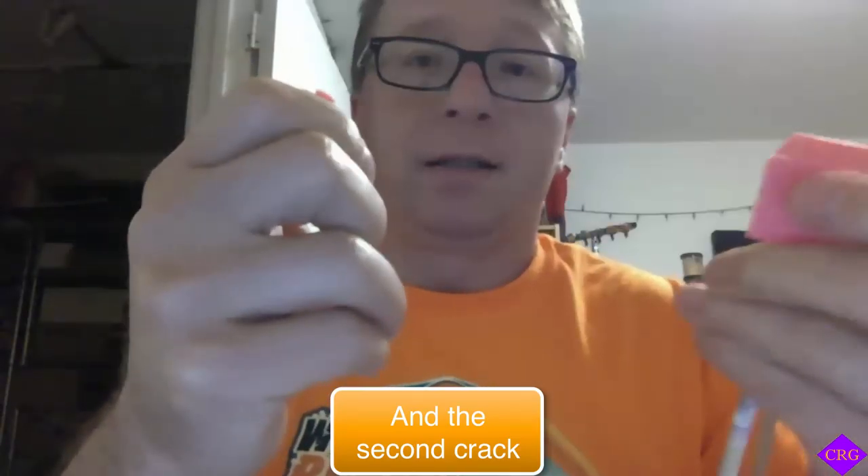What I also wanted to show you here is: it turns out this PLA — maybe if I were to use PETG or even ABS it would be stronger. But this pin, when I first grabbed it, it felt pretty stable. It doesn't take a whole lot of force though. I grabbed it pretty hard the first time, yanked it — it had a little teeny crack, and then a quarter of that force and it just snaps right off. You can see it snaps right on the print lines. I increased the fill density thinking that would help as well, and it did help, but only marginally.